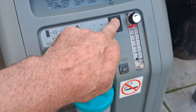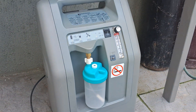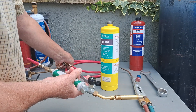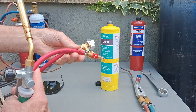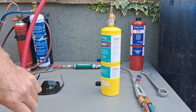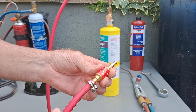There's the machine — plug it into the mains, switch it on, and you put your pipe onto there. I'm going to connect that up in a minute and there's your oxygen for welding. When connecting to the map gas or the small propane bottle, I put one of these little blowtorch guns on — I found this was the cheapest way of getting a regulator to fit on these bottles. I bought this little kit for about 25 pounds, just cut off the torch part, and it screws onto the map gas. You hook it up to your normal Sapphire torch via your hose, and I'll use one of these flashback arresters — they have useful little barbs and give a little bit more protection against flashback.